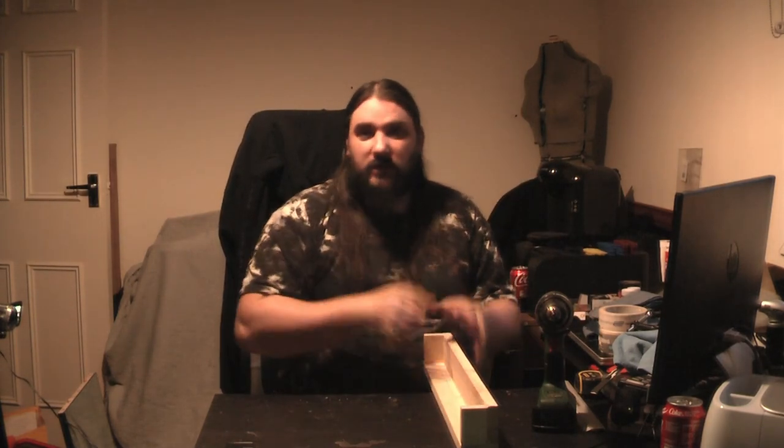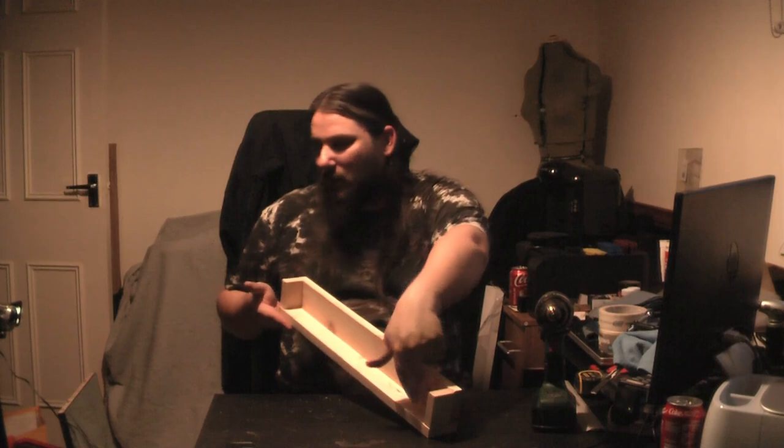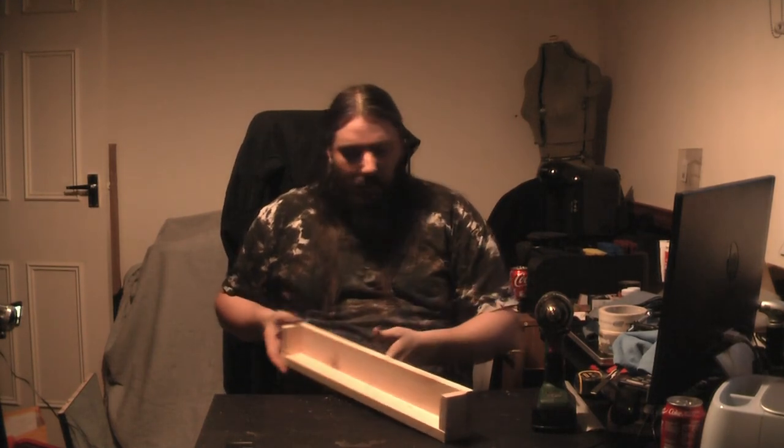And the other thing to mention as well, make sure your desk, your table, your workbench, whatever, is level. With this kind of lamination, it's not as important, because you are setting the pressure by weighting it for the glass, and with this through just the natural weight of the fabric and the resin. If you're going to start doing pours, you want to make sure everything's level, because obviously if it's like that, then it's all going to pool at one end, so that's always important.